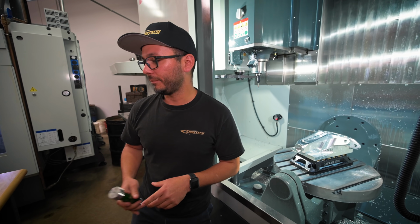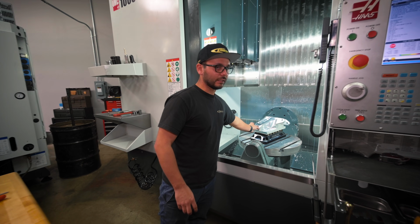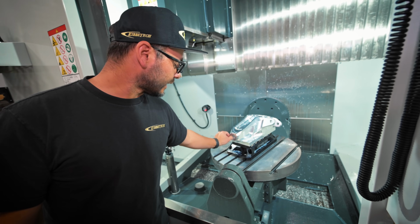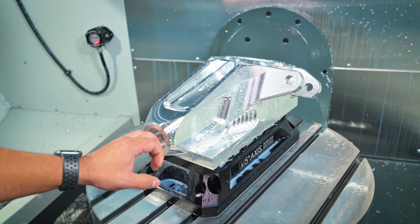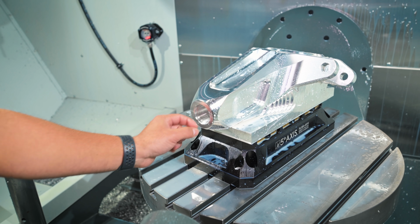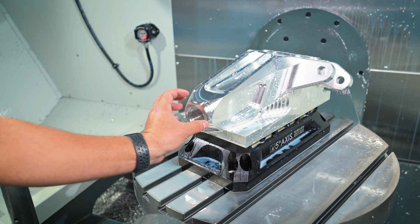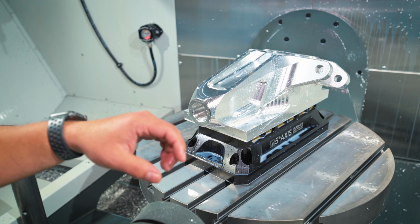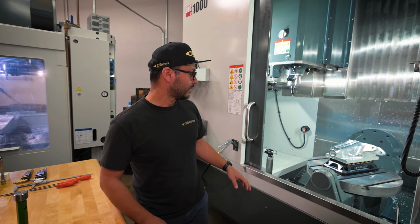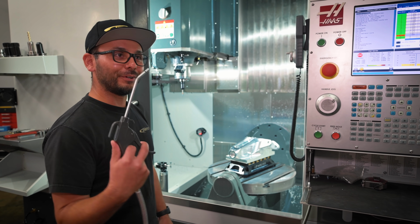And now we can hold that same tolerance when we're machining the mating misalignment, which is also going to be threaded. So this has a shoulder where the insert that we're going to be designing will sit for alignment, and then the thread's going to hold it, and it has 2 areas to seat on. And when we machine the misalignment that goes on there, we'll also do the same class 3 thread tolerances. And that's pretty much the last feature. We have a few little different things going on there. I'll blow this off. We can check out the B-roll when we roll this thing around.